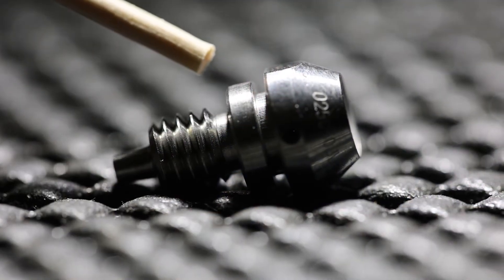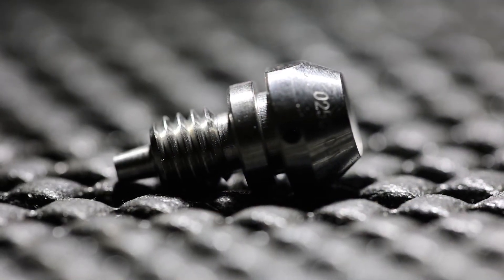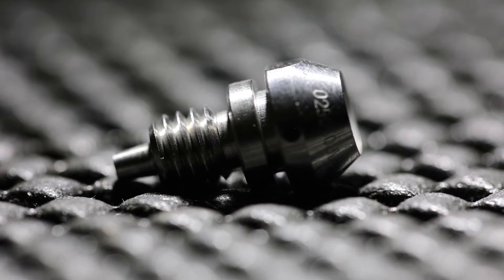So we'll go ahead and put that back in. The guide repeats quite well — it's got a nice chamfer on it with a slight taper, so the guide repeats within five microns.